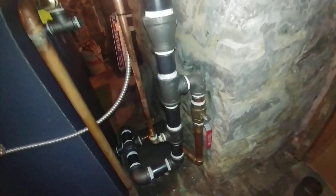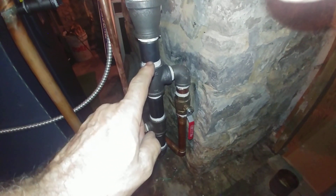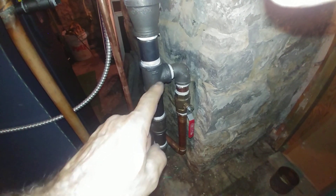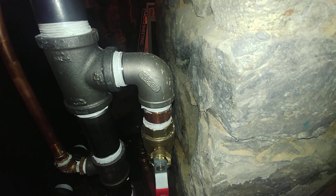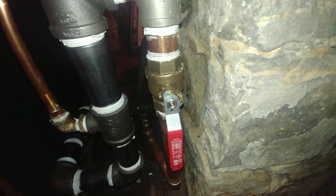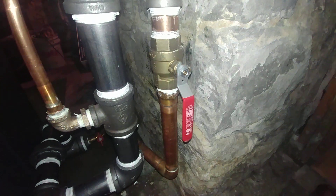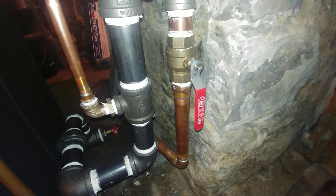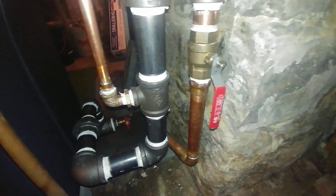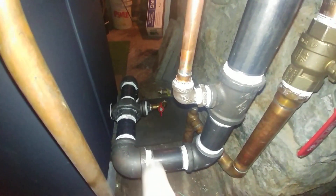So last we talked, I was going to cover the Hartford loop. We've got an inch and a half by inch and a quarter stainless steel street 90, then a short brass nipple and a shutoff valve for the no-return flush. We tie it on with some new inch and a quarter because the return coming in is copper. And there's the return going back there.